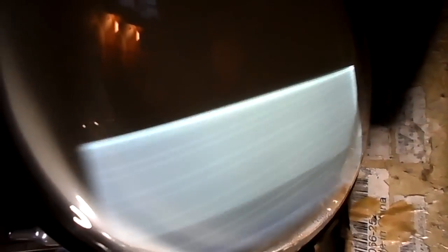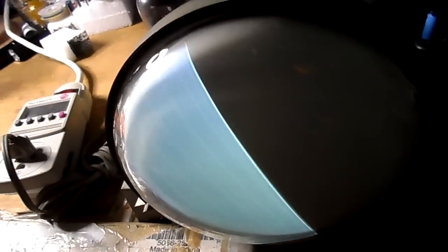I really would like to see what these controls do. That's horizontal. Mind you, the screen goes this way. So this is what we're looking at. It's the vertical I can't seem to get. Let's focus again. Yeah, so we're not getting full. That's pretty good. It's still only about half a picture. Let's get a signal in here perhaps and straighten that tube out a bit.